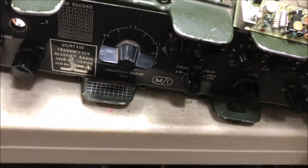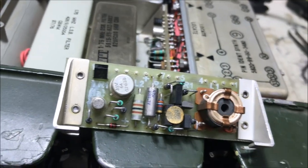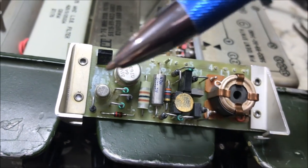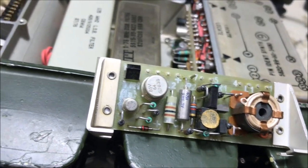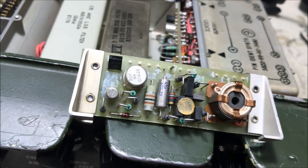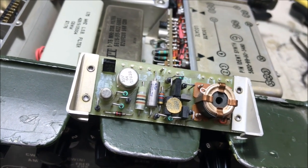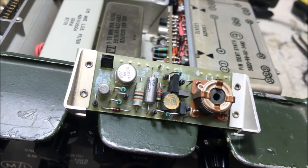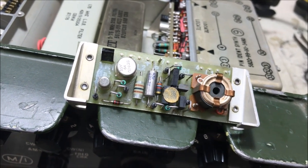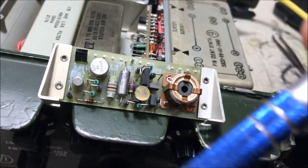I actually had a really good look last night at the circuitry for this particular part of the radio. It's a relay contact protecting circuit, where when you hit the transmit button, the transistor here takes the full load current of the relay, so that it just momentarily does that while the relay closes to protect the contacts on the relay. And in fact, they're two transistors, these two.